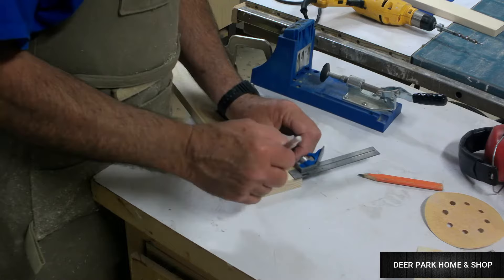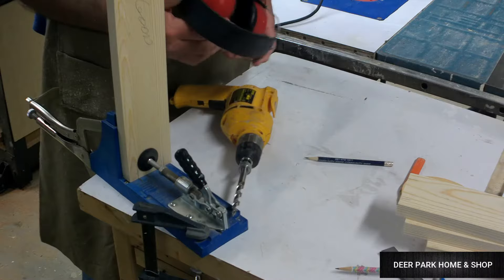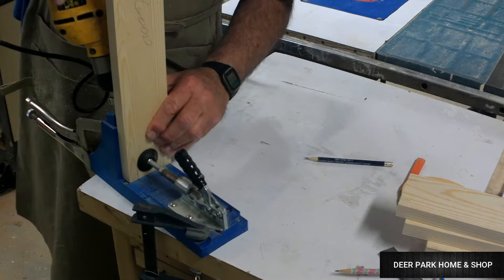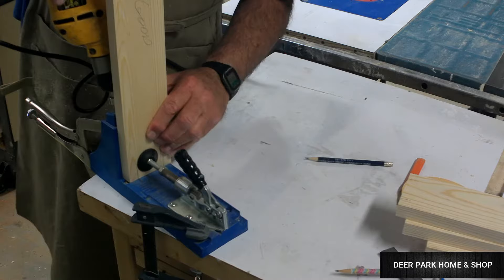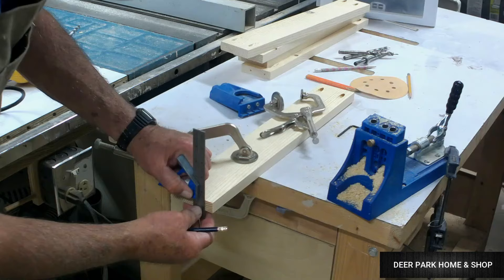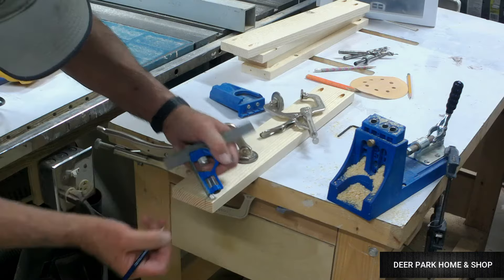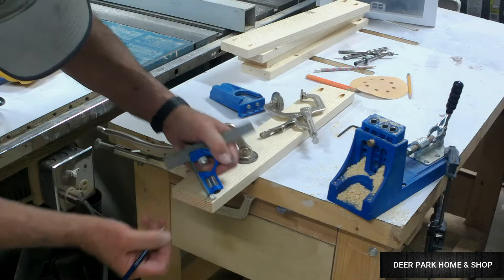Next, I'm going to put the pocket holes on the rungs. I set my square at a little over a half inch and make marks for my pocket hole locations on the front side of the board. When I put the board in the jig, I line up the marks on the board with the positioning marks of the jig. Notice that the good side is facing out — I'm actually drilling into the back side of the board, which is what you want to do. After the first one's cut, reposition the board and cut the second hole, then swap ends and cut the other end. If your jig looks different, extend your lines to make them work with your jig's positioning marks, and remember to make your holes on the back side of the board.